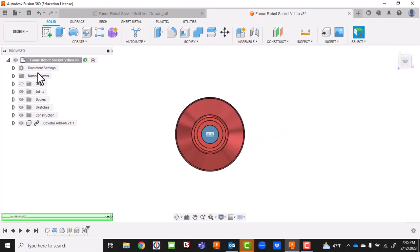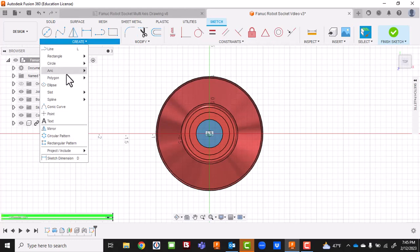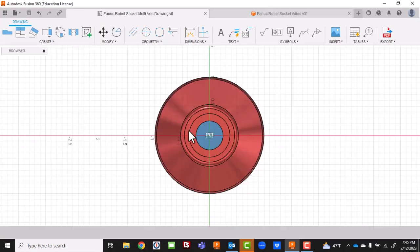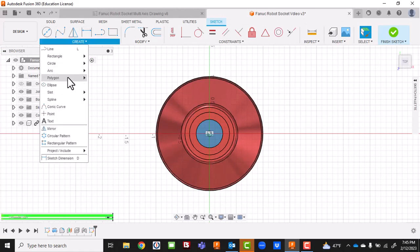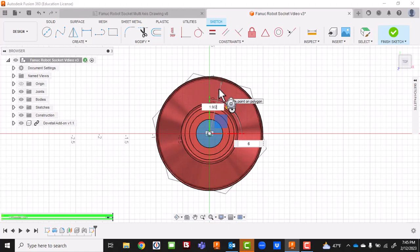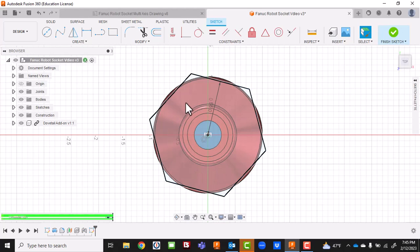I've saved - you can't save enough. I'll go to the front view of this part and put another sketch on the outside. I'm starting a sketch and going to Create > Polygon > Circumscribed Polygon. These are going to be my six flats. According to the drawing it's 1.9 inches across the flats, so if I want to do the math or I can just go back to polygon circumscribed and enter 1.9 divided by two, which gives me the same thing.